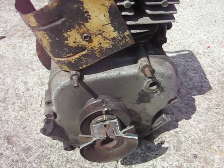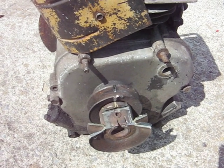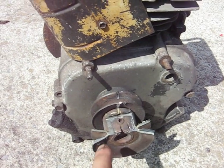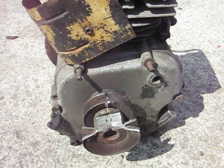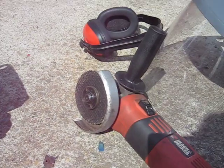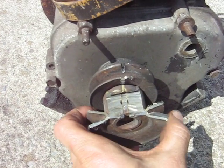This one here looked like a simple enough deal — just cut the pulley off it — but the set screw was seized. I tried everything and it wouldn't come off. So I got out my zip disk and cut it and got the pulley off.